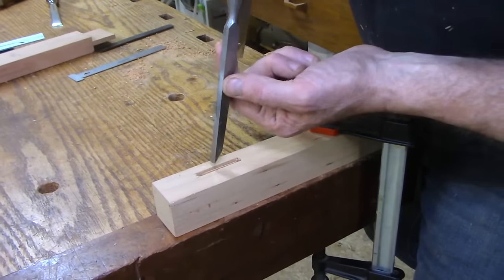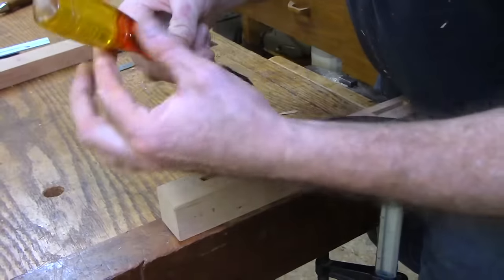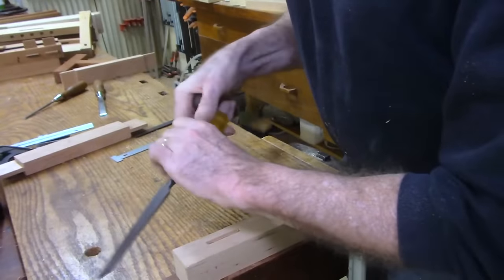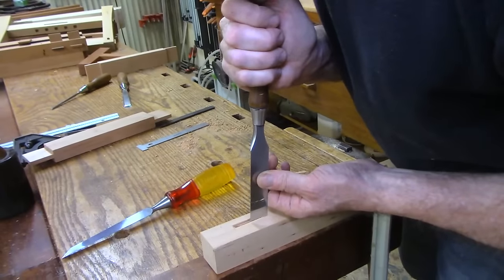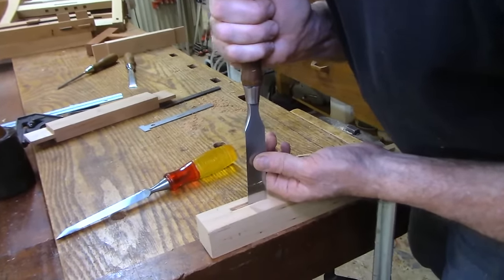And when you get down there, you're holding it as plumb as you possibly can the whole time. That's why it has this flat handle, so it gives you a better orientation to true. And that's why it's so beefy, because it's making all those end chops. However, with this method, you just need to shear these sidewalls, so you're using a wider chisel and you're using the knife line in a different way.